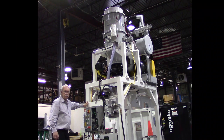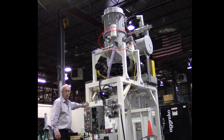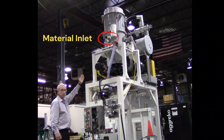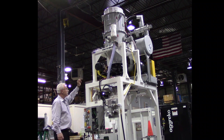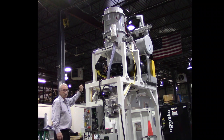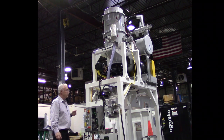The 1040 filter housing is unique in that it has three different locations for the inlet, depending on where you install the vacuum system and how it orients to your tubing network. From the factory, the standard location is in the center as shown, but there are two flange fittings 90 degrees apart from that center location where the inlet can be relocated. When relocating the inlet, you also need to move the level probe in the filter separator to another location; there is also another inlet on the other side of the vacuum.